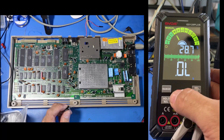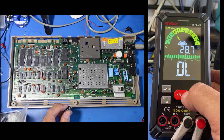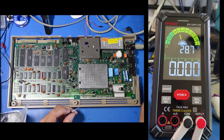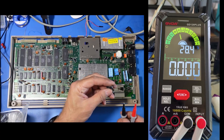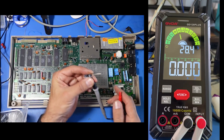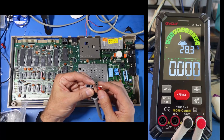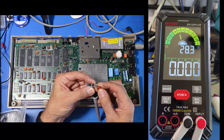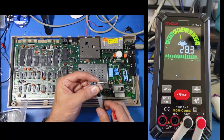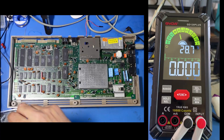You can use this button to go back into the menu. You've got diode mode, and here you've got capacitance test — I can never say that word — but this will measure capacitors as long as they're out of the board. This is a 1000µF cap, so we're going to put negative to negative, positive to positive, and just see what it reads. There you go — 935. So this is great for spotting bad caps: pull the cap out, switch to that mode, and try it. That's another great feature.